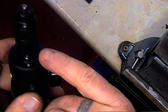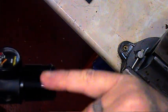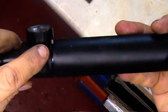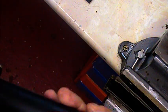And then as you see, that point and that point line up. That's ready to go back into the air tube, should I say, sorry. And again, same principle. Smear the O-rings, just the eases with reassembly, and away you go. Just wind it back in. Don't need anything tighter than by hand with this, so just make sure these two faces meet. Give it a little pinch. That's the air tube reassembled, ported, ready to go.